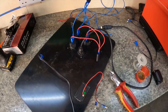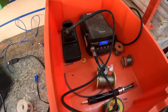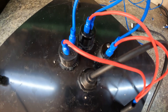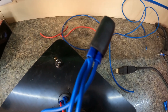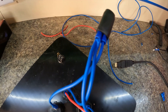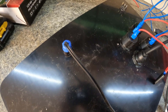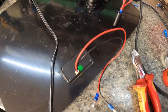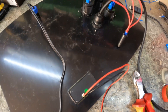We're now into the wiring stage with all components fitted to the case. You'll want a decent soldering gun and some terminal connectors — it's pretty straightforward, not rocket science. All sockets are labelled positive and negative, so it's a case of matching them up. I've used bullet connectors and insulated jointing sleeves, with a drop of hot glue on them to prevent movement. The charging point goes direct to the battery; from the battery it goes through the power switch and feeds all the adapters, with the volt meter also connected direct to the battery to show charge condition and charging status.